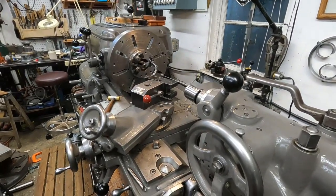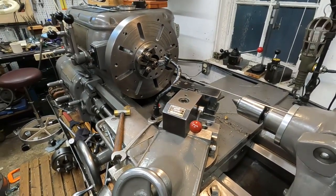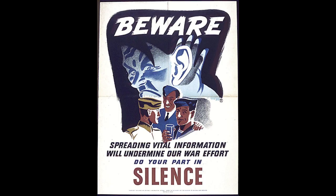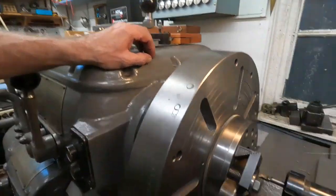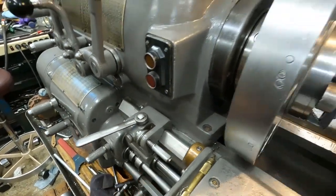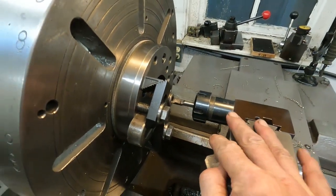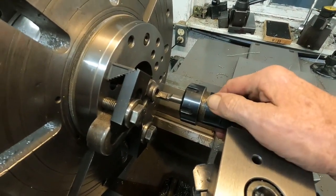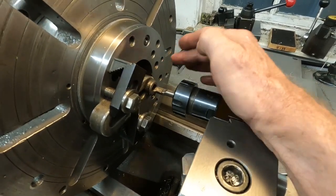And I will find a suitable cutter, and I'll punch that 1/2-inch hole out to 5/8. I'm laying out full-time tooling here. Okay, I got this set up here, and I've got a hard stop here so I don't crash into this. This KDK works really good boring with, I got an ER32 very cheap collet chuck with a 3/8 insert boring bar. We'll see how that cuts.